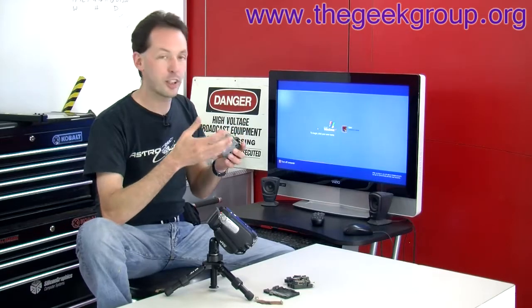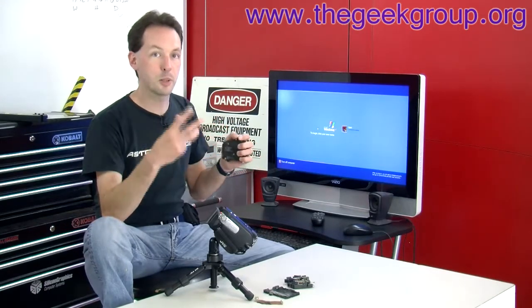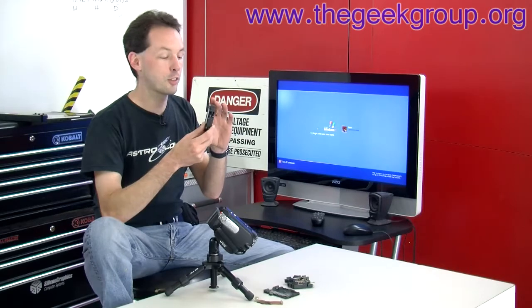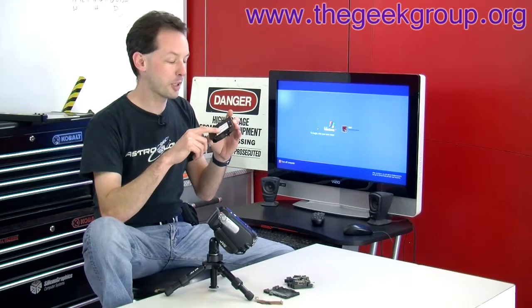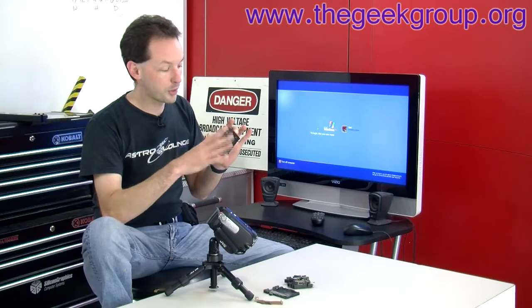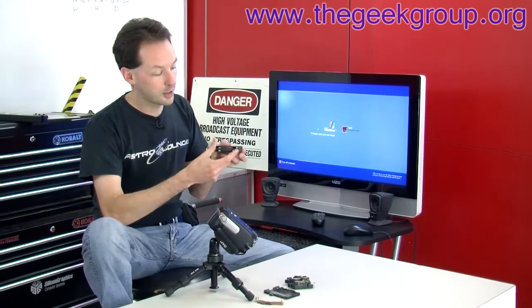In a lot of residential environments where you tend to have really small breaker boxes and people are always trying to cram in one more circuit, one of the common things to see is a single-phase breaker that only uses one slot in the cabinet but is actually two separate circuits — two completely separate 20-amp circuits.